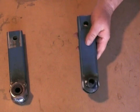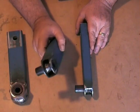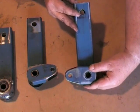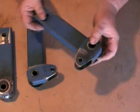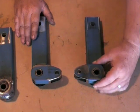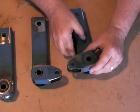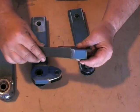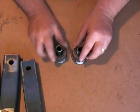We are going to look at 2 more suspension arms, which are the same except they will not have the boss on them. I have welded through the bushing the same as the others, fitting a small arm so the whole thing acts like a bell crank. We now have to think in left and right — these will basically be a mirror copy of each other. This lever is welded on square to the suspension arm. Before I do that, I'm going to reinforce this open area by welding a flat bar all the way around it.